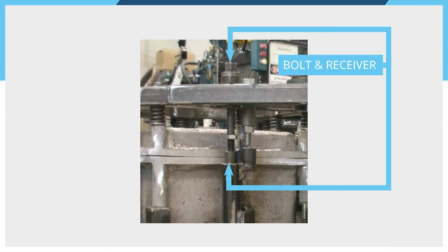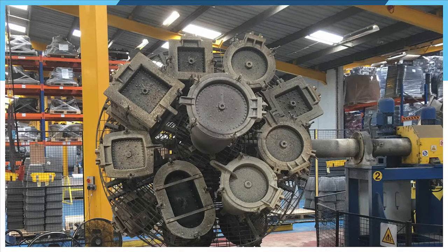However your parting line is fixed, it can always be damaged. This usually happens when the parting line hasn't been maintained properly and a stick-up has happened. A typical scenario is this: the mould comes out of the cooler, you undo the clamps or the bolts, you try to take the top half of the mould away, and it won't come. Something is stopping the two halves separating.